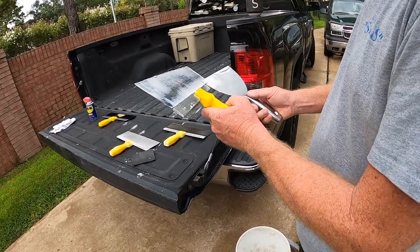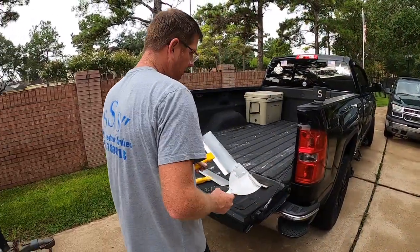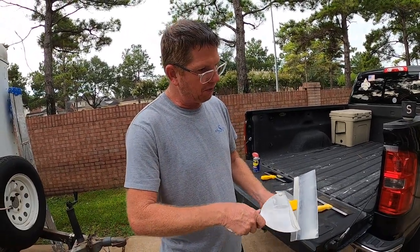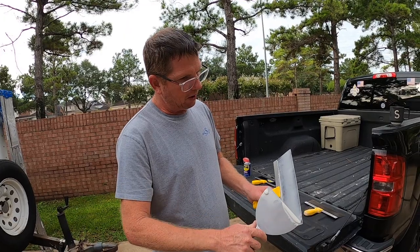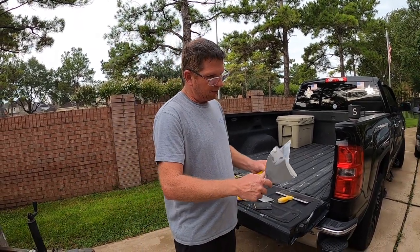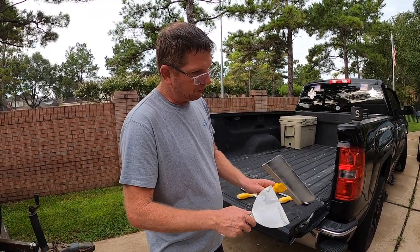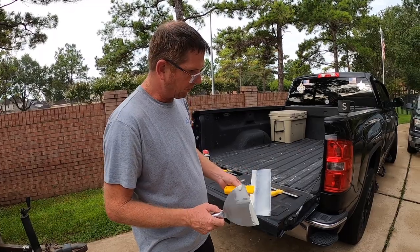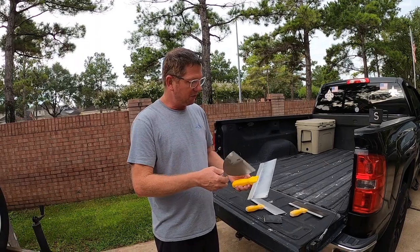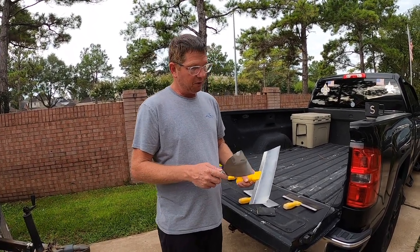Assuming you don't have to use it immediately, let this dry overnight. In the morning it'll be dry — you scrape it off and that'll help remove that tarnish. So to recap: we sanded everything both sides, knocked our corners down, sanded the top of the blade, and put a real light film of mud on there. Let that dry overnight.